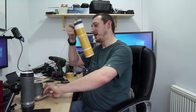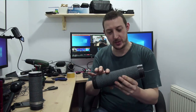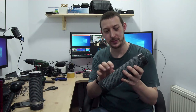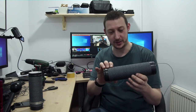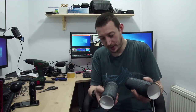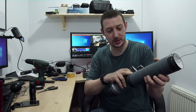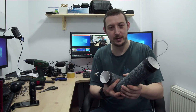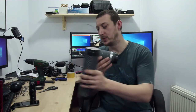Roughly 30 to 40 minutes later, and one or two blisters I didn't have before, this is what we've ended up with. The critical thing is to make sure you get the right thickness of string — try to get it about the same thickness as the wire. If the string is too thick your clamp won't make contact as you slide it up and down; if it's too thin the wire will probably short out. It's a bit longer than the other one, which should give me a little more inductance, which is what I was after. I've put tape on the ends just to tidy it up.